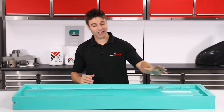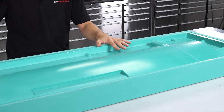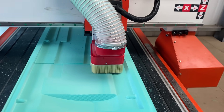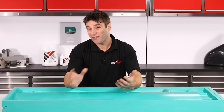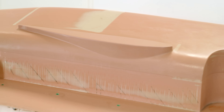Getting started on the project itself, the pattern I've got here is for the upper wing skin for a small VTOL UAV drone that I've been working on. I've machined this from epoxy model board because I intended these patterns to make prepreg tools. But if I was designing these just for this resin infusion tooling method, I would have gone for the less expensive polyurethane board. This lower temperature process means that many different pattern making materials would be suitable, whether that's foams or MDFs.